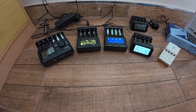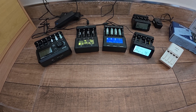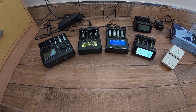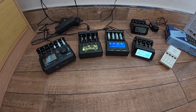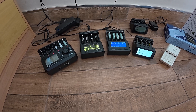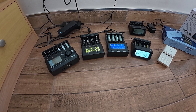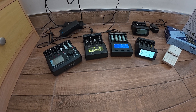For those not familiar with battery chargers, they all do four basic functions. They will charge batteries — so if you have batteries that are in good condition but are low on capacity, they will charge them to full capacity. They will also discharge batteries. You may think, why do you want to do that? The reason is to test how much capacity the battery has got. You fully charge it, then discharge it, and it tells you how much capacity that battery can hold.